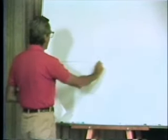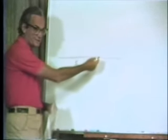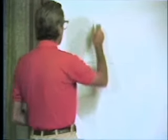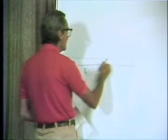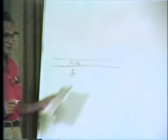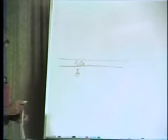And there's a layer of very beautifully made, very pure silicon. The reason is any piece of dirt or scratch or anything that's wrong with it is a great big monster boulder at this scale, and you don't want any dirt. So you get very pure silicon. And then in a vacuum, you let in oxygen. Then what forms on the surface of this is a layer of a compound, silicon dioxide, which is simply quartz or sand or like glass. It's a thin layer of glass, which is an insulator. Silicon is a conductor. See, we're going to build this thing up.